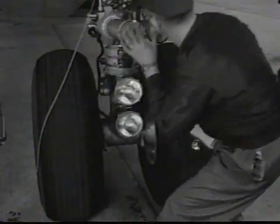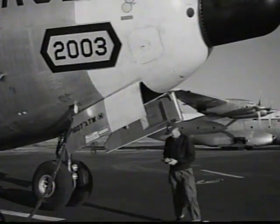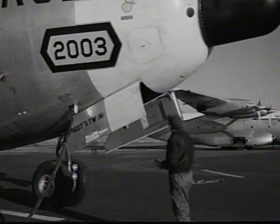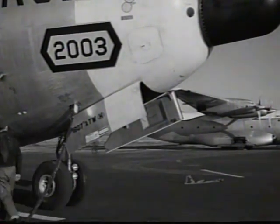Make sure a static ground wire touches the ground. Check condition of nose wheel, tires, and steering mechanism. The nose access door is the last check item in the walk-around inspection.